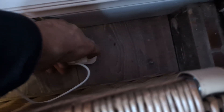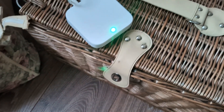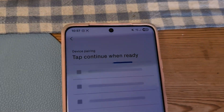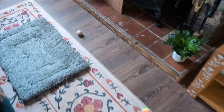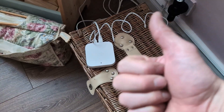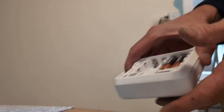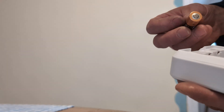The customer downloaded the app and plugged this in last night, and it's actually got a green light on. You might think to unplug it and re-plug it back in, but no — we've still just got a green light. Before we put the batteries in the thermostat, we want amber on the receiver and on the hub. So we've gone into the app and clicked on 'find thermostat.' We've now got an amber light on the receiver and on the hub.